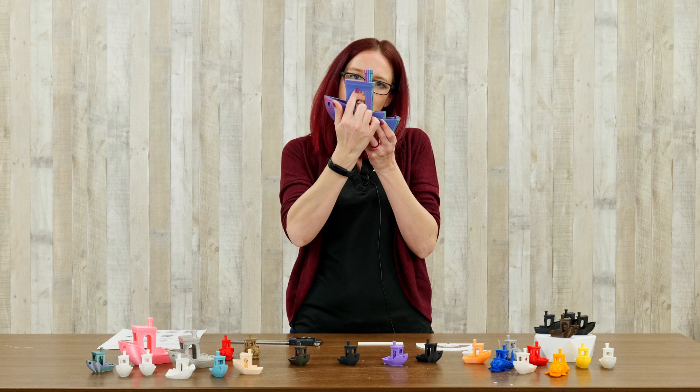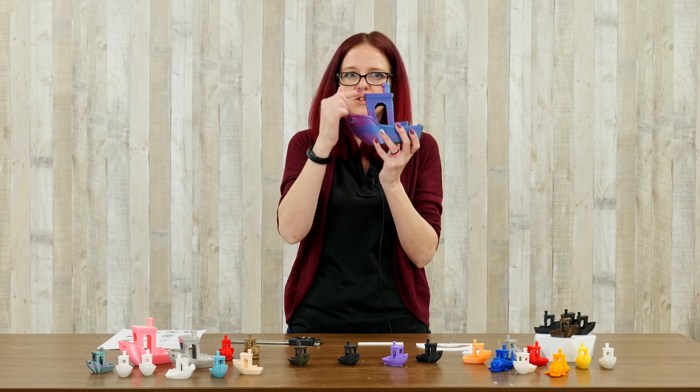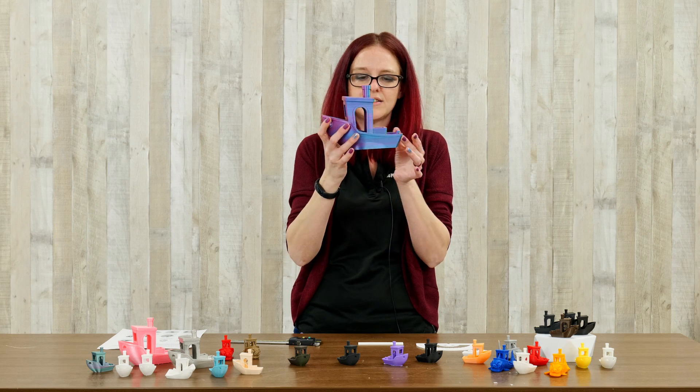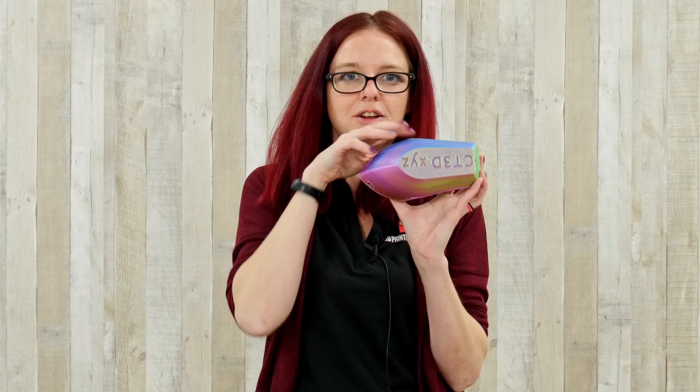All of these little arches throughout here are the same idea. If you're starting to get droops and drops and drags, that means it's time to start fine-tuning all of the settings. If you flip him over, he does have letters on the bottom — you should be able to read them clearly. If you can't, that means your nozzle is set too close to your build plate.